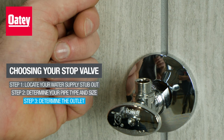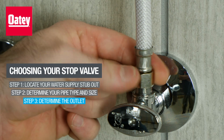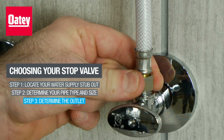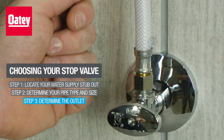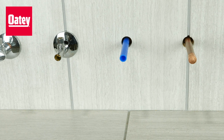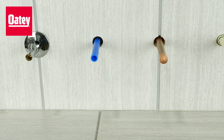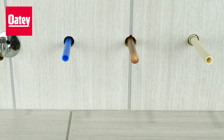Lastly, ensure that the outlet on your stop valve coordinates with the inlet on the water supply line. For example, a valve with a 1/4-inch outer diameter can only be used with a water supply line with a 1/4-inch inlet. Oatey offers stop valves that are compatible with your waterline material, size, and stub-out location, with outlet options that coordinate with Oatey supply lines.